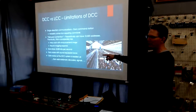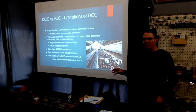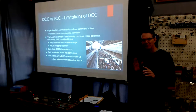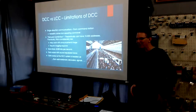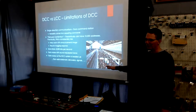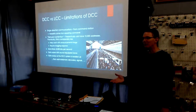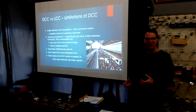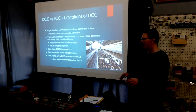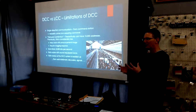The other thing is it's a pretty low data rate. Not to get into the weeds, but 8,000 bits per second. Most of our phones are on gigabits, millions, billions of bits per second. Even our dial-up, remember our dial-up was 56 kilobits? This is almost a tenth of dial-up. Pretty slow. What's the reason for that? Because of all the noise. You've got railroad wheels, you've got static, you're picking up junk like that. So you want to make sure it's slow enough that you get those signals through as quickly and clearly as possible, but it gets clogged and congested.